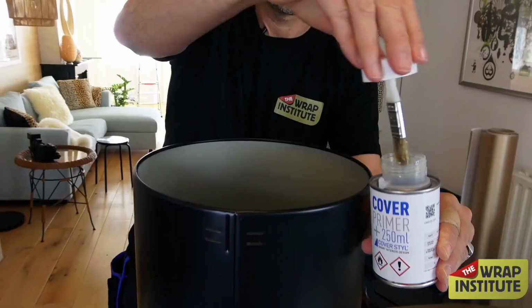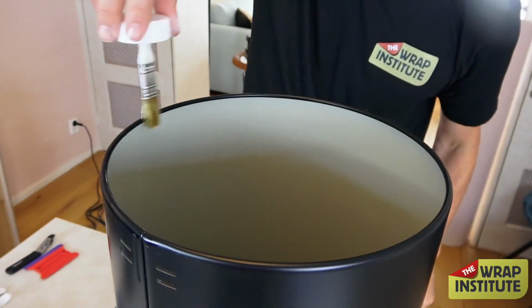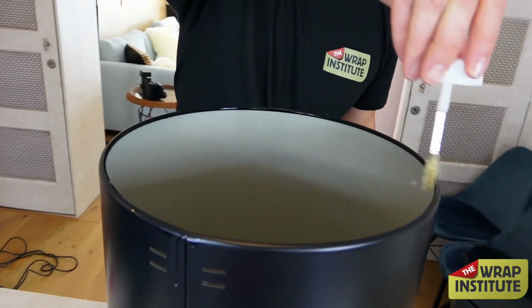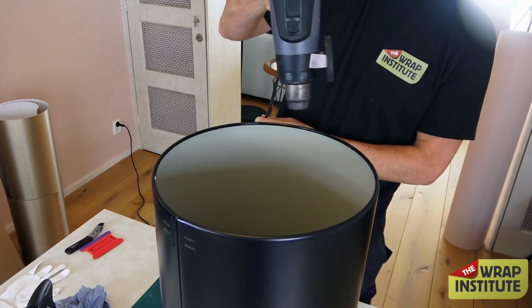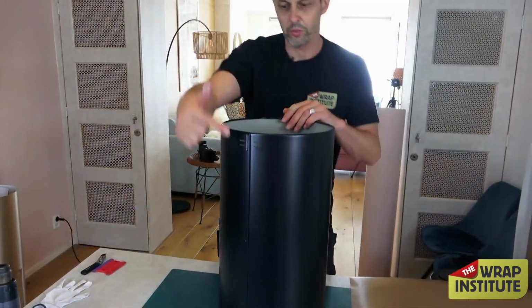So make sure all the edges are degreased and the bottom section of the table is wiped to remove dust. And now coming in with an adhesive promoter right on that upper lip. You really want to make sure that material holds for the long term. Material going on is an interior film, very thick and brushed gold metallic textured. So there's different tension points. That's why adhesive promoter is really important. And you want to make sure it's dry so the install can start right away.